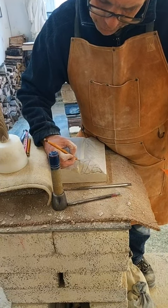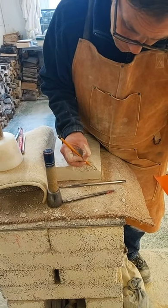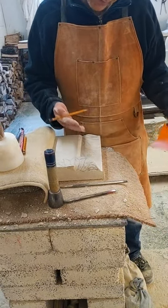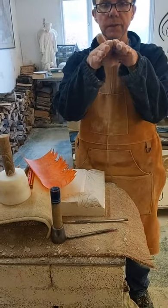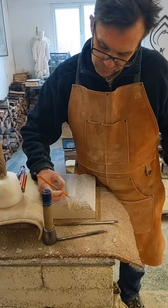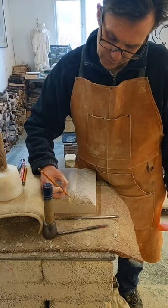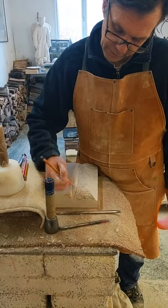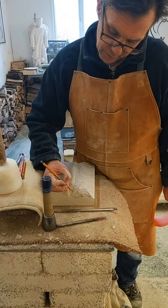So this is a V cut. These would be V-cuts, so they would be like that. And because these are coming over, these are the other way, so they're a kind of apex. So this will be the high spot. This will be the high spot. Although obviously this is higher than this spot. So you carve this leaf first, with this central vein as being the high spot. Cut into there, so this goes down there, and you've got that kind of shadow in there.